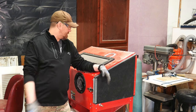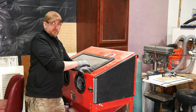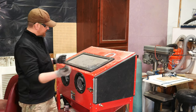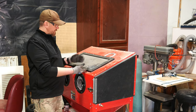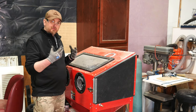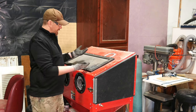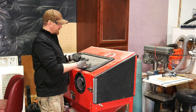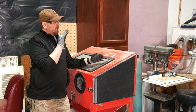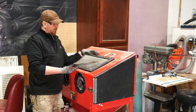So I'm just going to take some of those ideas and incorporate them myself. The reason I cut the glass is to replace the glass in the window right here. Harbor Freight includes a glass window with these little plastic tear-off sheets — as it gets sandblasted on the inside you can tear off a sheet. But the problem is that swirling motion inside the cabinet can create static electricity which causes the plastic to stick, and you can't see anything. So the idea is to buy cheap pieces of glass from Home Depot, cut them to size, and use them as the replaceable liner.